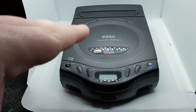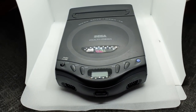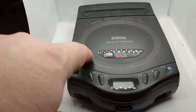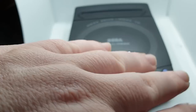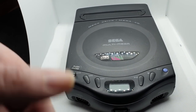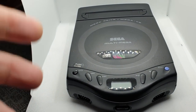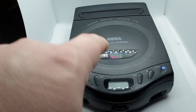But that does come with its downsides — having everything compressed together did cause some issues with the system. You get noise and interference in the picture. When you play it on an old CRT you wouldn't notice it as much, but you get jail bars in a lot of Sega stuff — lines down the screen in certain colors. When you're using something like an OSSC, the Open Source Scan Converter — not upscaling but line doubling — it shows everything crystal clear, so you saw a lot of noise and it made this unbearable to play.